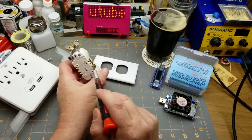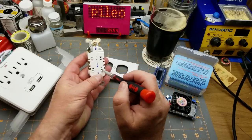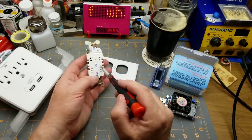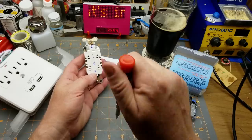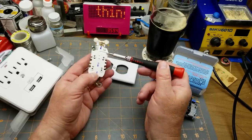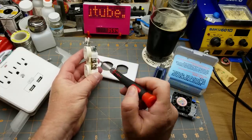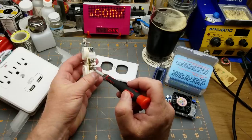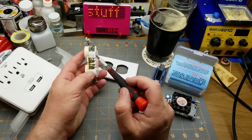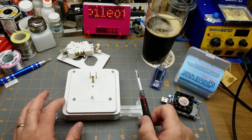From the factory they're bridged together so this can be one 15-amp circuit feeding both sides. This outlet also has push-in quick-connect holes in the back similar to what I've seen European outlets use, with a small tab slot to release the wire, and a strip gauge for the jacket length. Electricians typically still use the screw terminals for security, but push-in meets code and both are valid.